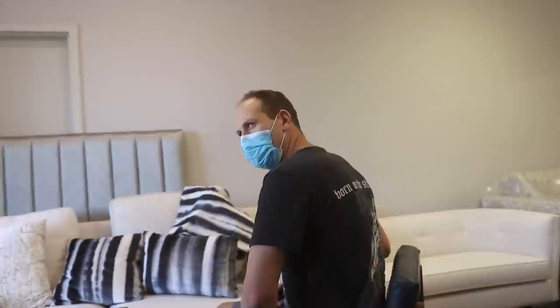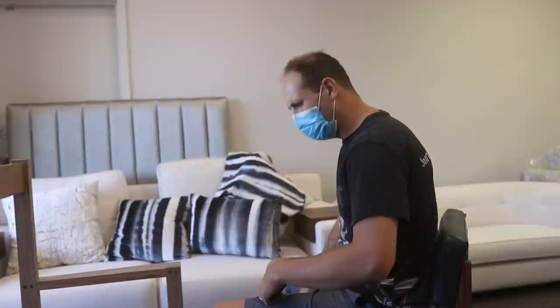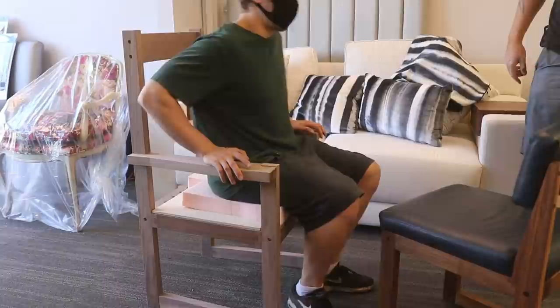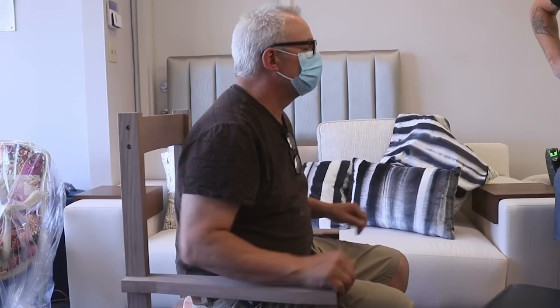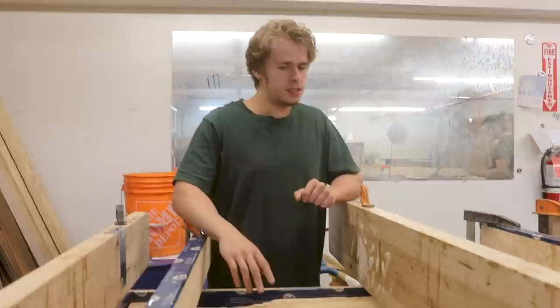This seems a little bit soft. It's all preference, right? Especially with leather you want something that gives a little more push. If you want to get a little more luxurious with the seat, as opposed to just putting 2 inches of foam on a plywood seat, you could cut this out and then we web it, then put the foam and you have a little more give. Josh brings up the point that the foam is going to compress over time, so eventually you will hit bottom. Whereas if we had the open bottom with the webbing, it still gives you that comfort. Let me take this chair and I'll let you know when it's done and we'll go from there.